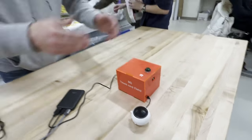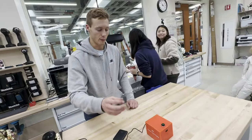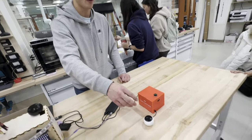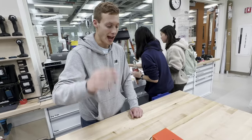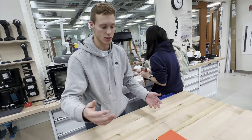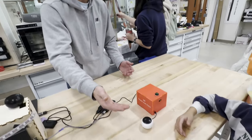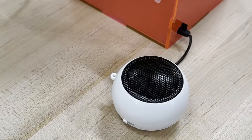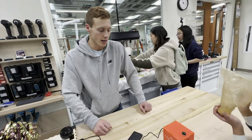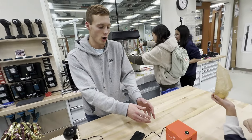Then you move out of the way and start your run. What it's doing is it starts the distance sensor when the gun goes off, and then when it detects that nothing's in front of it, it stops the timer. So after my run, I come back, click the button, and it will tell me how quickly I reacted. I coded this in CircuitPython and used an Arduino Nano RP2040.